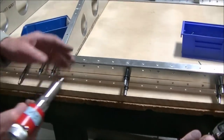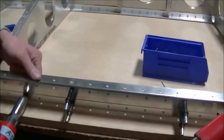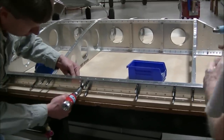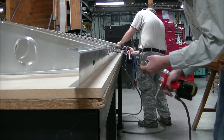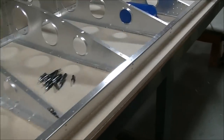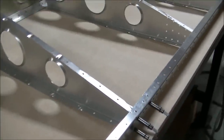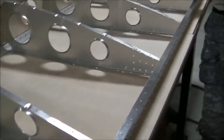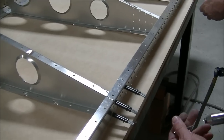In your home environment you probably won't have two riveters and two workers — you'll probably just be one person, and it'll take a little bit longer, but the skill set is exactly the same. Because everything is completely pre-drilled and match-drilled, it's really not critical that everything is jigged or anything like that. You just cleco all the parts on a relatively flat table — that's about the only thing that's important, because everything is already pre-determined by the match-drilled parts.